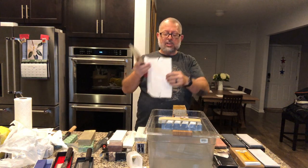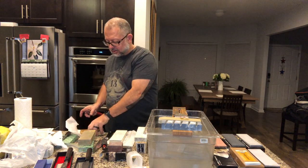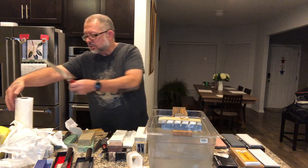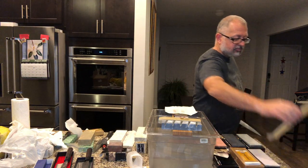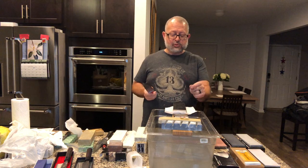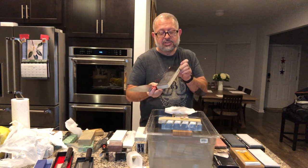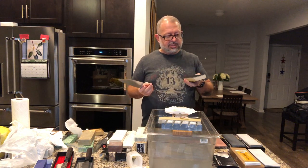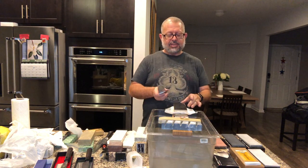That was a cut. All right, so let's get some leather. So this is the Bob Kramer leather strop. I don't know what kind of leather it is. It's kind of smooth. I don't know if you can see it in the light, but there is some residual, probably hardly any left on there, 0.25 micron diamond paste. I think that's supposed to be like 96,000 grit.